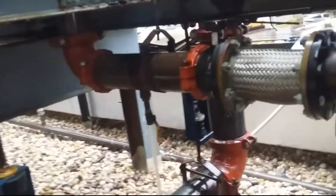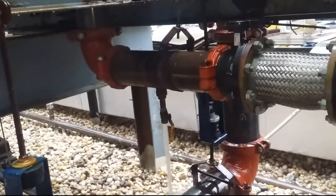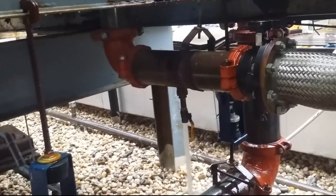If the water gets cold from the heat pumps, we have another heat exchanger that will warm up the water. The pump that comes on maintains 80-85 degrees water temperature, and this goes to a bypass and the warm system loop.